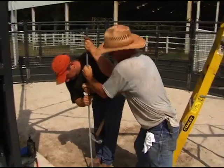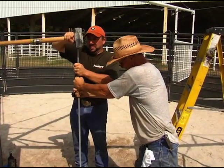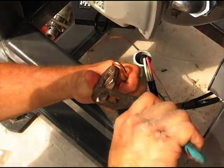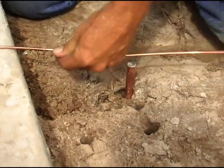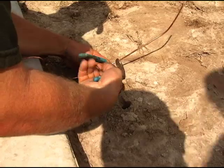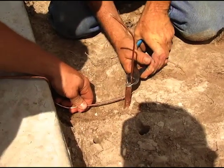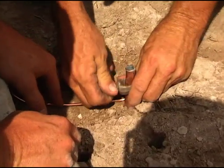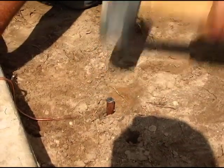Connecting the ground rod: drive the ground rod beside the walker base and attach the ground wire to the rod and to the charger. When attaching the wire to the charger, make a small loop at the end of the wire using a pair of pliers and attach it to the ground connector on the charger. Run the wire to the ground rod, neatly positioning it flush with the concrete pad. Using your pliers, curve the wire upward at the point where it reaches the ground rod. Cut off any excess wire past this curve, leaving approximately 1 to 2 inches of wire pointing up. Using the wire connector, attach the wire to the ground rod, then drive the rod and wire into the ground using a sledgehammer.